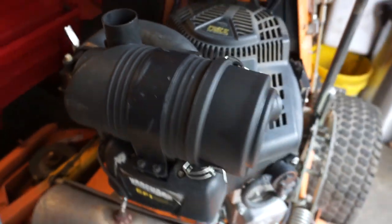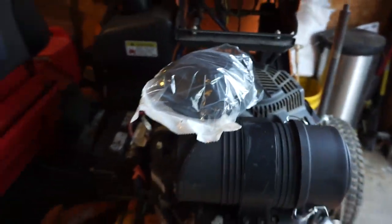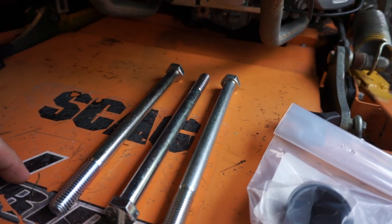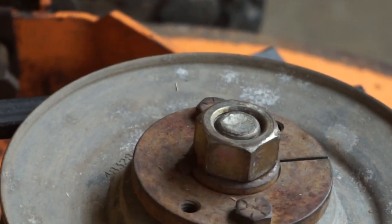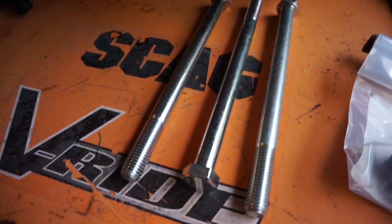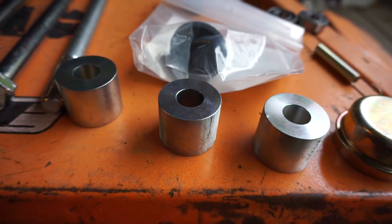I got all the stuff I needed for the air filter - this little breather thing goes here, and this is that little dust and rain mushroom cap. I got all new blade bolts because I noticed when I changed the blades out, two of these were bent. That's pretty sure what's going to be causing my issue - right there on top of that spindle the bolt is actually underneath the top of that nut, but on the other one the bolt sticks up past the nut, and this one is about a half inch lower with the bolt completely bent. I also got all new spacers to go with those, because a lot of the spacers were mushroomed out and deformed from impact.